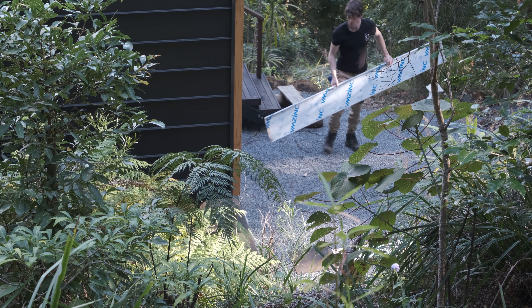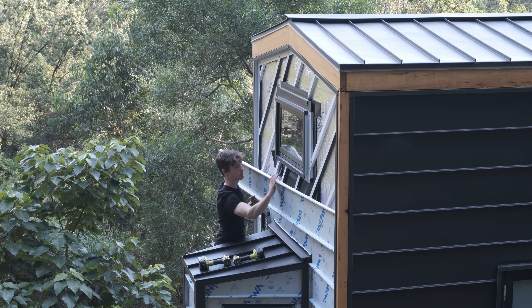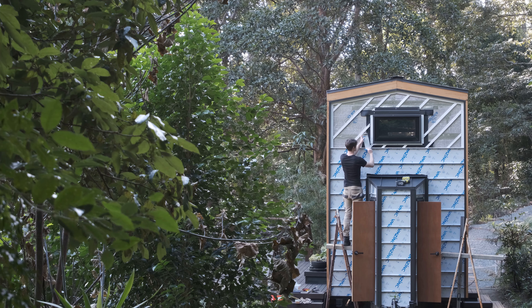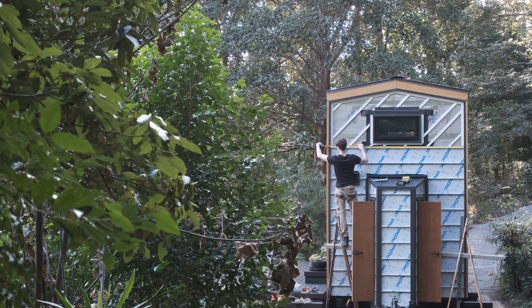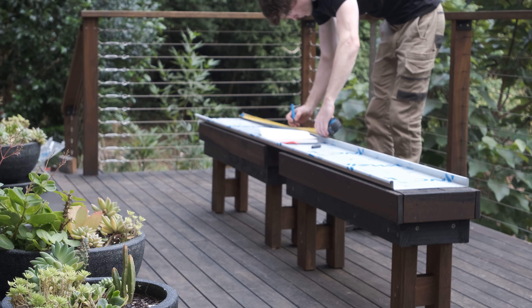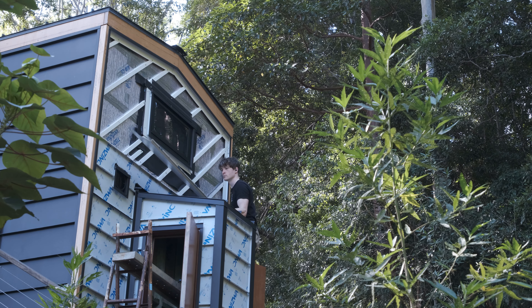While standing seam is a durable style of cladding in and of itself, I decided that if I was going to the effort of learning and building such a robust system I'd also like to go overkill and use one of the most durable metals possible. The panels and flashings I'm using are made from pure zinc. When steel is galvanised it is either coated or dipped in a thin layer of zinc to protect it from rust, because when zinc oxidises it forms a self-protecting layer that inhibits further corrosion. So as you might imagine, these panels and flashings made entirely from zinc should have a very long lifespan. A great benefit to working with zinc is not having to worry about sealing any cuts made to the material because they will not rust the same as steel, and it's also a more malleable metal than steel which makes doing the bends for this cladding a little easier.